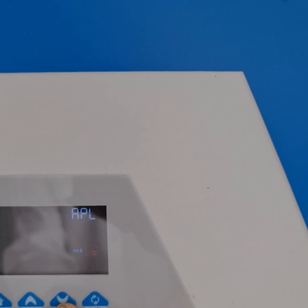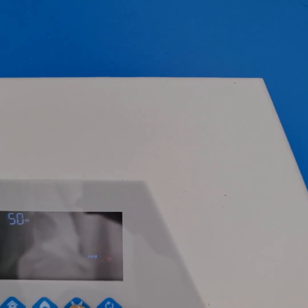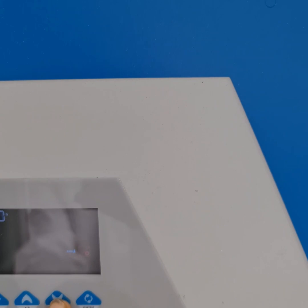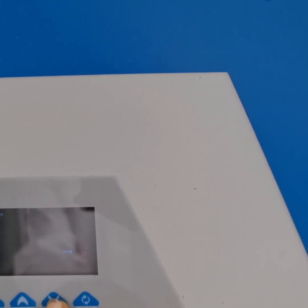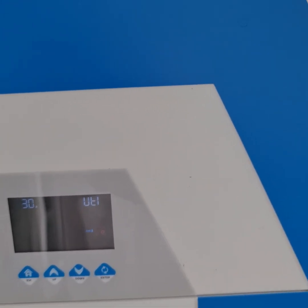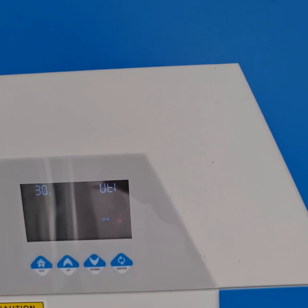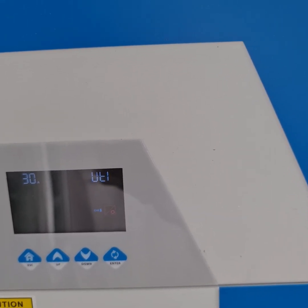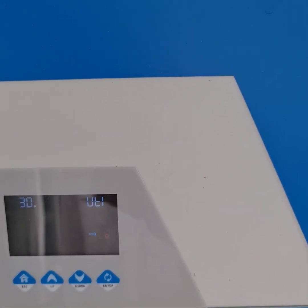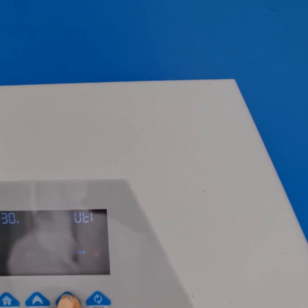Number 3 is the appliance voltage setting; I set it to 3 — you can look that up in the manual. Number 10 sets the AC frequency to 50 Hz and the required voltage. Number 11 sets the maximum utility charging current, meaning the maximum current the inverter will take from AC. I set it to 30 amperes.